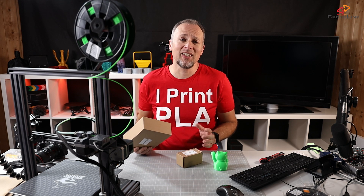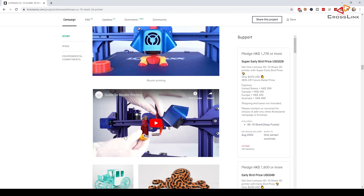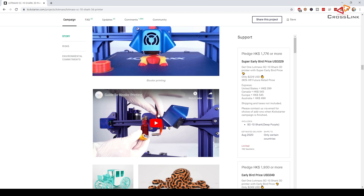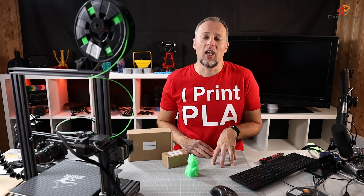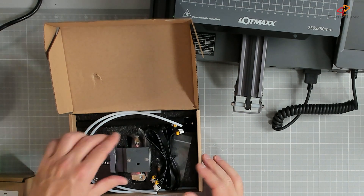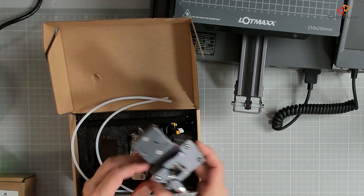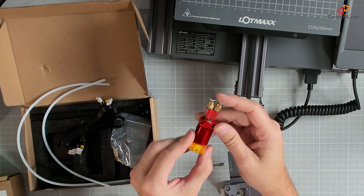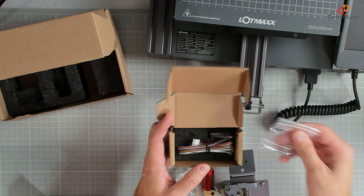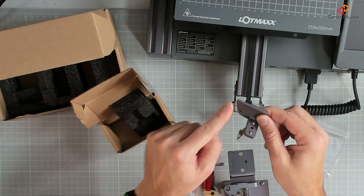Next I want to apply the bicolor printing head and auto leveling kit, since you can basically leave them on all the time. On the original Kickstarter page there's a nice guide on how to apply the bicolor setup, which I'm linking in the description. The bicolor kit includes a second extruder motor — the same setup as the first — which mounts to the top of the frame, plus a replacement dual-color nozzle with heat block, two PTFE inlets for a two-in one-out hot end setup. The leveling kit is a BL Touch sensor with a small mounting frame that attaches to the side of the print head.